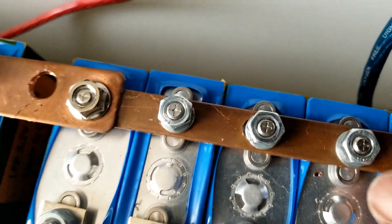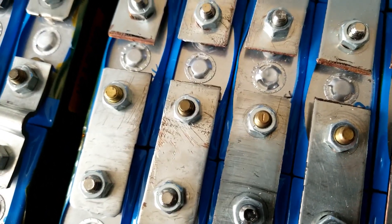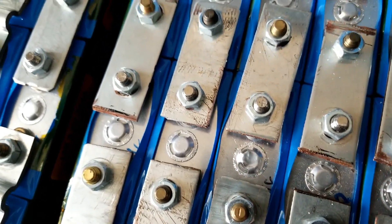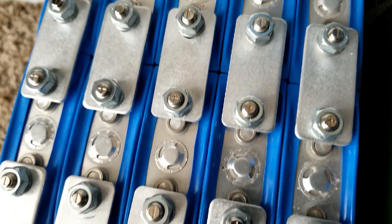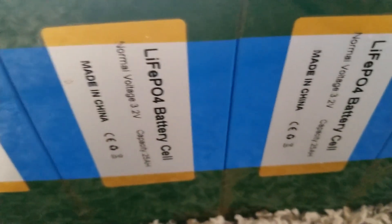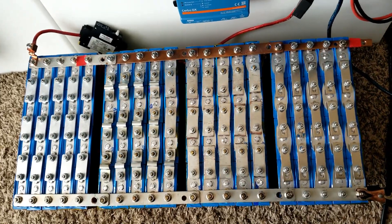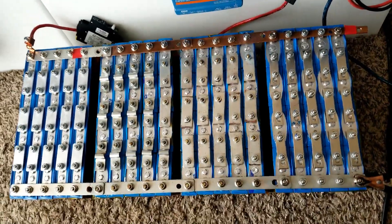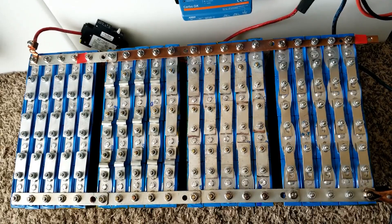You can see some of them have the plus marked on top, so that tells you positive from negative. These other ones have the marking on the back — you can see the plus on top of the bolt. Look at these earlier versions — this one here has the positive on top of the bolt as well. You can miss that, so you still have to check properly. These batteries are manufactured outside the United States, so you have to use a multimeter and make sure the polarities are correct so you don't end up in any trouble.